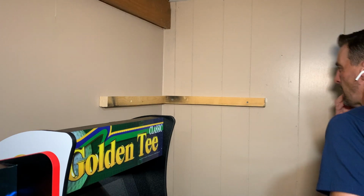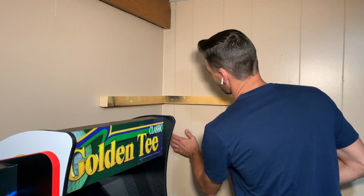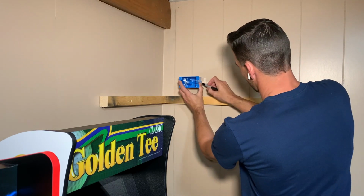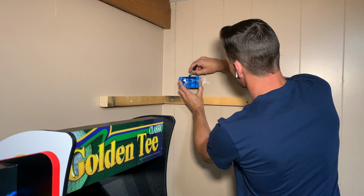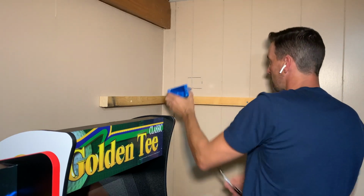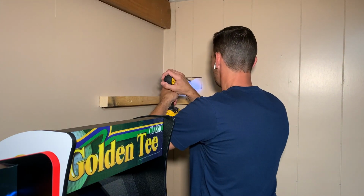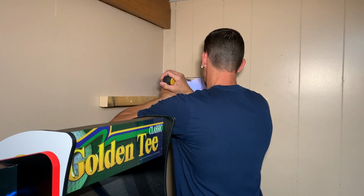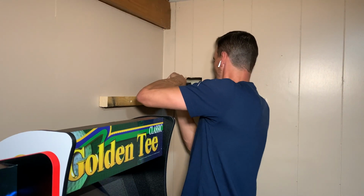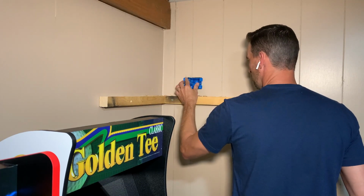So to continue the illusion of the floating TV on the floating shelf, I wanted to hide the electrical also. Now I'm going to accomplish this by installing an outlet just above the shelf towards the back where all the cables and plugs from the TV and the DVD player can be hidden and tucked out of the way. And what I'm going to basically use is the void in the wall between the 2x4 studs, and we're just going to drop an extension cord down and drill another hole out of the wall next to an existing outlet, so we'll just be able to plug this in.